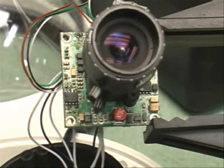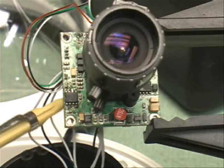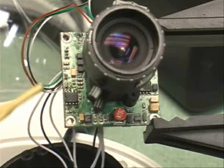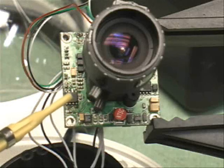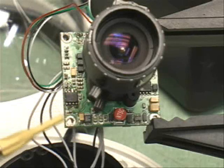So I decided to go in and investigate further. It's an SMD board and the components are really compacted together, so it was going to be quite a challenge. I've taken apart the dome camera and what you see here is the CCD with the circuit board. This is a double-sided board and the LSIs, or large-scale integrated circuits, are underneath. On top, this one in particular is a dual op-amp that has to do with the secondary portion of the power supply.